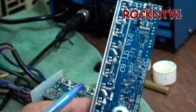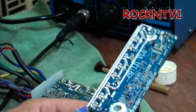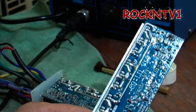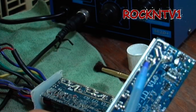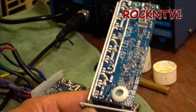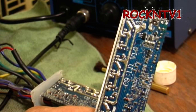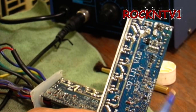You can see wire buried in the main traces, but where the legs connect to the MOSFETs there are big gaps — no solder where the leg mounts to the board. So even though current-carrying capability exists a sixteenth of an inch away, one FET is getting less voltage than another. A difference of even microvolts and microamps between FETs means one is working harder than the other, making one motor phase less efficient.